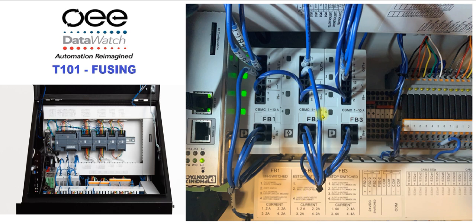All the common wires are blue with a white trace. There is no label on these common wires. All the 24-volt DC wires are labeled with the fuse block 1-1, which is the channel. It is associated with the first channel in the fuse block 1. Labeling tells you what you're hooking to.